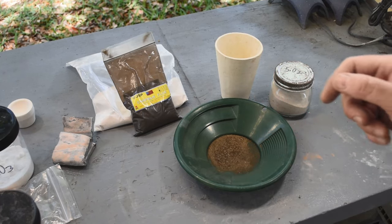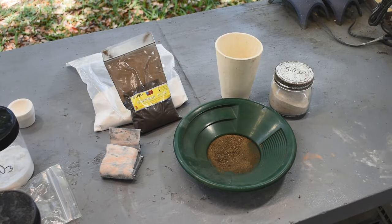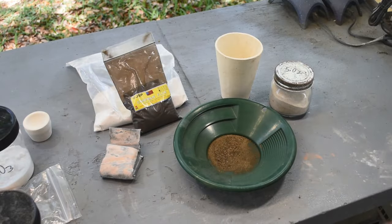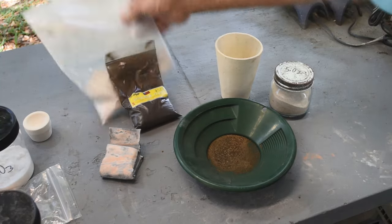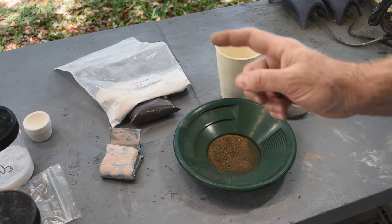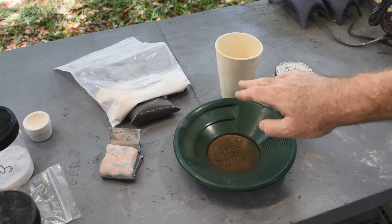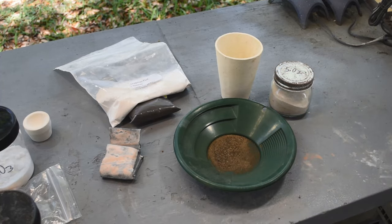That's an old prospector's trick — add a little finely divided silica to your cons before roasting and they won't tend to stick together. The silica prevents that, so instead of becoming a big lump that doesn't get air, it'll stay a fine powder and hopefully get a good roast. Instead of using litharge and carbon, I'm just going to put some lead in there — maybe 10 grams. I'll add some thinner to the Chapman's flux to thin the consistency so fine gold has a better chance to fall down to the puddle of collector metal at the bottom.